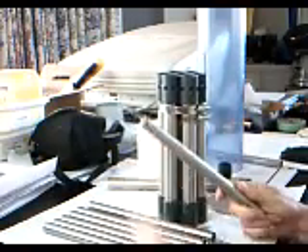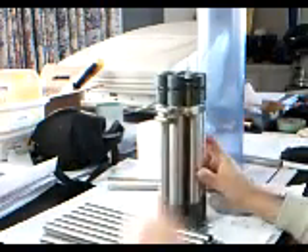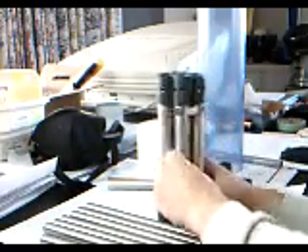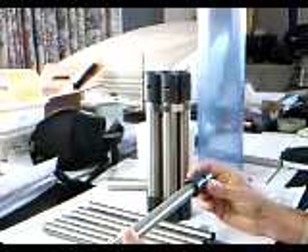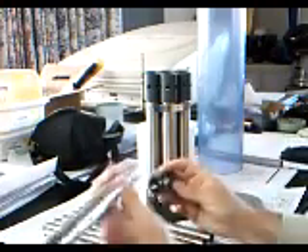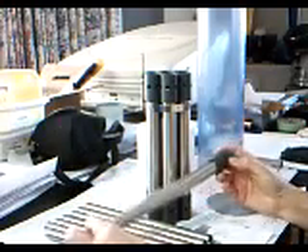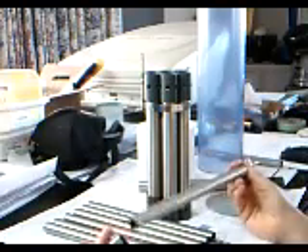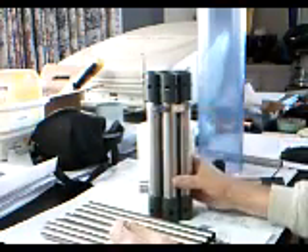I've already attached the cathode to the inside tube, as you can see up here, and I've already attached the anode rod here to the outside tube using stainless steel strapping. Everything inside the electrolyzer water vessel is pure 316 grade stainless steel. With the end caps as they are, the 19mm fits snugly into the inside and the outside one fits quite nicely, giving you a tube capped at both ends. The cap is responsible for the cavity which is 1.57mm — these have been machined on a lathe.